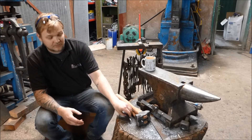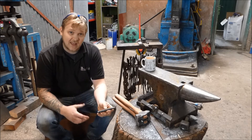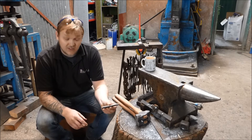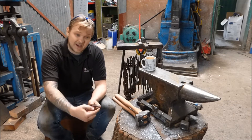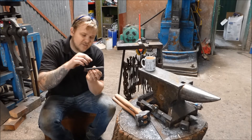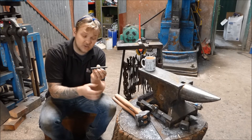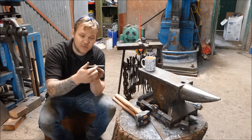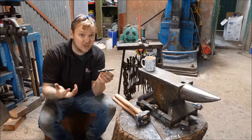So what's the point of heat treatment? A good example is the centre punch, which takes full advantage of the qualities provided by steel after heat treatment. This object was probably forged first and then heat treated so the tip has been made hard, the back has been made soft. We want the tip to mark non-hardened steels or other metals, and we want the back end to be hit by a hammer without shattering. A tempering process ensures it doesn't shatter but still stays hard, while the body stays rigid in use.